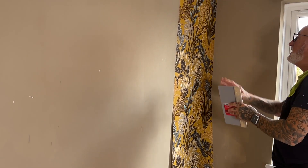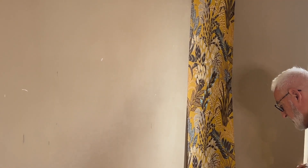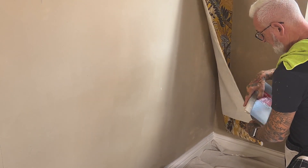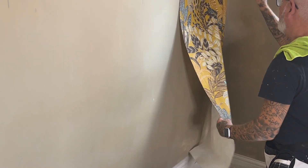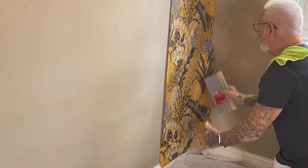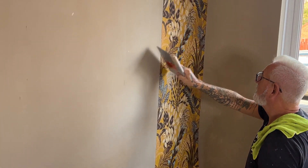There are two ways of doing this: while you're up on your steps or hop-up you can make your cuts, or you can smooth all the paper out right down to the bottom and then make your cuts afterwards. So open up the bottom fold, and using my blade I'm just going to run down the paper vertically — not twisting it — checking it to our level line.